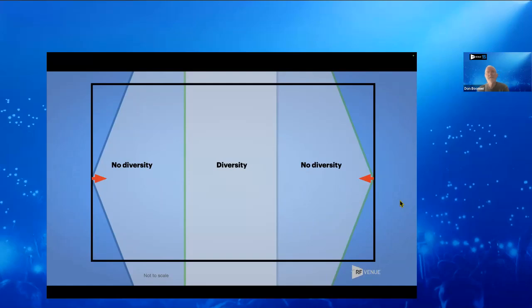But you've got to maintain a somewhat equal ratio of antenna A and antenna B for diversity to work, right? So again, if this was a football field and I had antennas under each goalpost, as I get close to that one antenna, the 30-yard line, the 20-yard line, the 5-yard line, somewhere, it's so strong compared to the other antenna that it no longer makes any sense to switch to the other one, right? So I'm not going to get diversity.